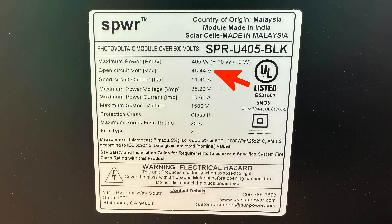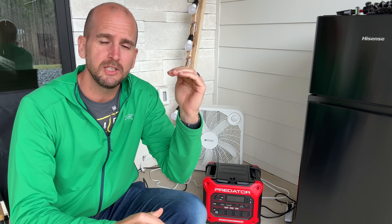The unit charged to 100% just off solar in about three and a half hours. The panels I used are 405-watt panels — the open-circuit voltage is 45.44 volts, which is under the 50-volt maximum for the Predator 2000's solar input. But remember, you always want that buffer: in cold conditions your VOC could go up, and going near the maximum could either damage your unit or cut off solar input so you won't be charging. Those 405-watt panels are a nice match, one on each branch of the parallel splitter.